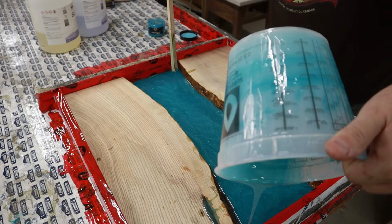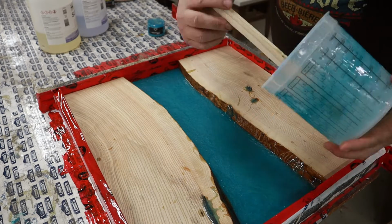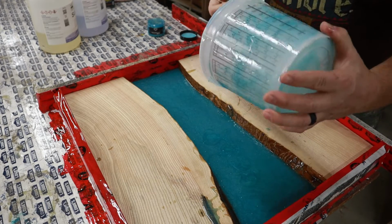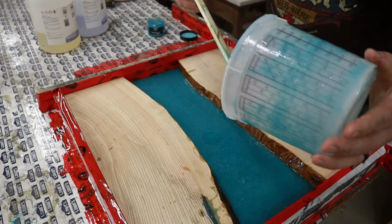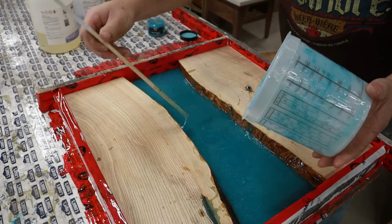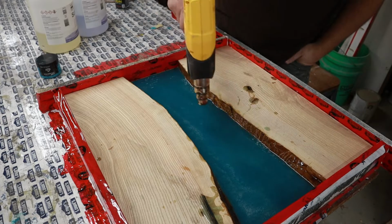You got to watch the temperature and just make sure it doesn't get too hot. If you feel like you're mixing too much and it's getting too hot too fast, you need to definitely scale it back to that 1/4 inch depth. Otherwise, you could have the epoxy crack. Now, I have never had it crack in instances like this, so I keep pouring just a little bit deeper than that. Otherwise, it just takes a lot of pours to get to where we want to go. So we're probably hitting more like 3/8 on the thickness here. I have even gone a half in the past.